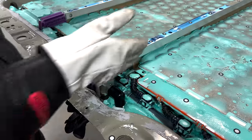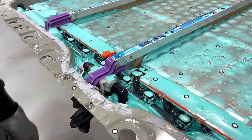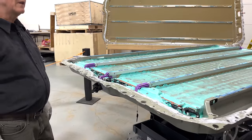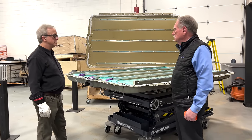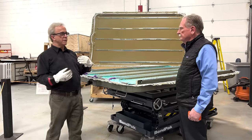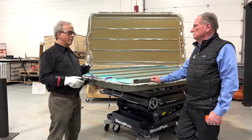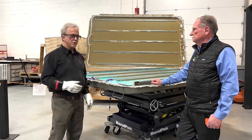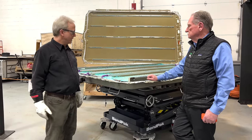They may have put a flow restrictor in there to equalize it, or some other way of making it not disproportionately cooler or hotter. It might be a header - one pipe that's a little different, a little bigger - and they may just need flow back or flow forward. It is common in battery design to have multiple coolant paths with flow restrictors to equalize flow. You have a flow monitor that allows you to adjust the restrictors until you get even flow down every channel, and how much flow you want is a function of a computational fluid dynamic study.